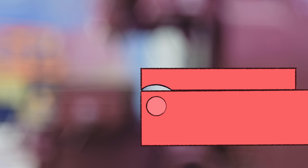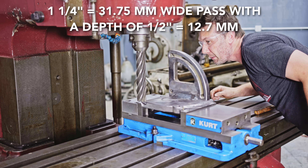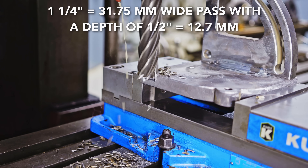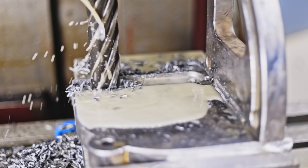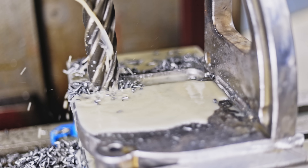I'm going to put the clearance into the plate by creating a groove with an end mill. This definitely would have been a lot easier before the two plates were welded together. I need a slot that's an inch and a quarter wide and about a half inch deep, and this big Cincinnati machine makes quick work of that. Machining inside corners is really tricky, so having that really long end mill is very handy. This is the clearance I was looking for — let's go test it.